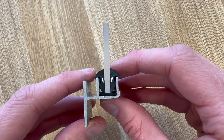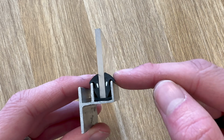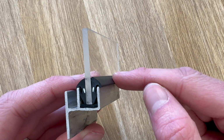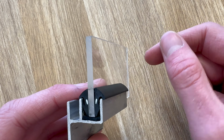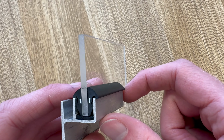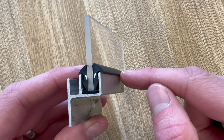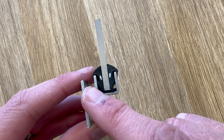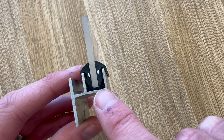There are several different ways of measuring the gap. The first option is to remove the existing wedge gasket from one side of the window frame. You can do this by finding the end and then gently lifting it out by a couple of inches. It is best to only remove a small part of the wedge gasket from one side of the window. If you were to take it out completely, as I will show you in a moment, you may find that the wedge gasket on the opposite side pushes the window pane over, and that leaves a gap which is difficult to measure.